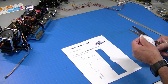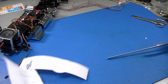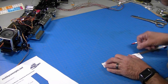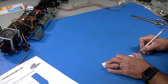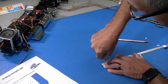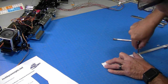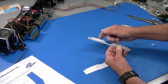This is for the front mount, and the back mount is the same. So I've got my piece of aluminum and a pencil. I'm going to draw this arc on here, draw the end, and draw these little notches. I'll use a center punch to center punch the holes. Then I go cut that out on the bandsaw and drill the holes with an eighth-inch drill bit.